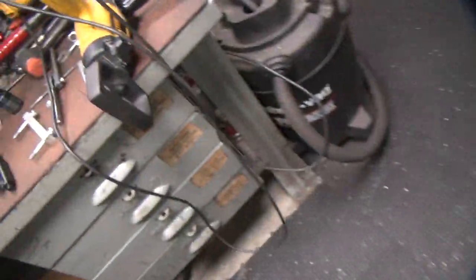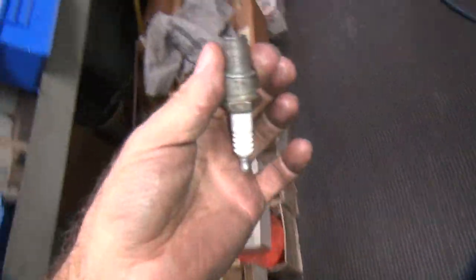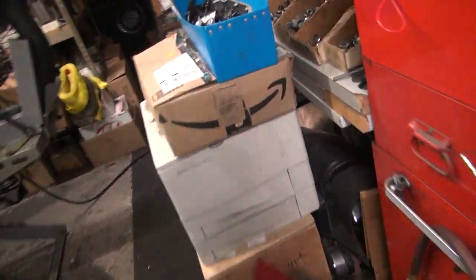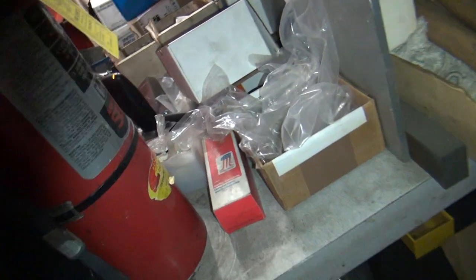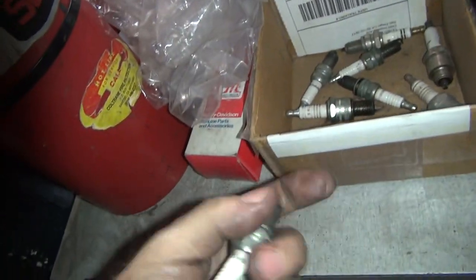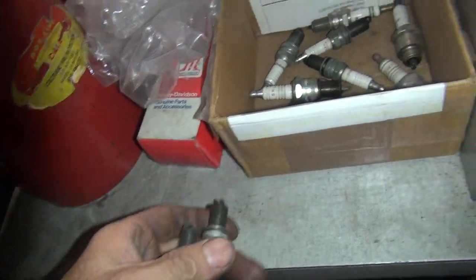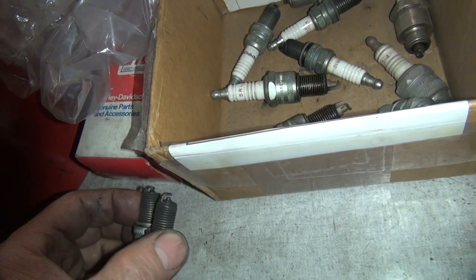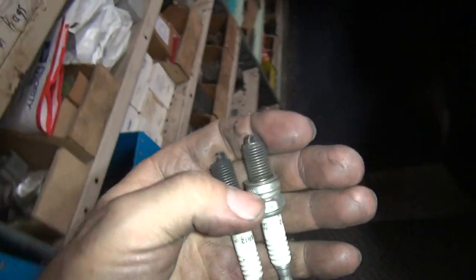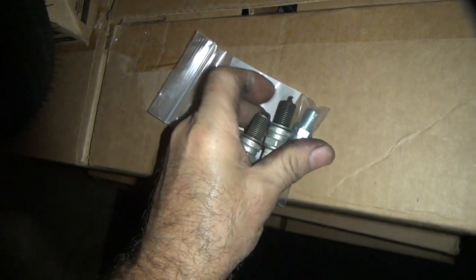Oh, this takes a small little plug in this motor. Stupid twin cams. Doesn't take real Harley plugs, it takes modern stuff. It takes Evo Sportster plugs. Damn foreign vehicles. Get some of these little pygmy things over here. Are these smaller yet? I think these are it. Yeah, they gotta be 10 millimeters. Compression release will tell me. Yeah, that's 12, so that's 10.